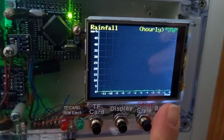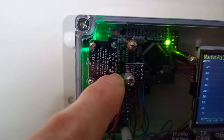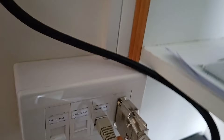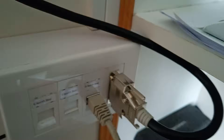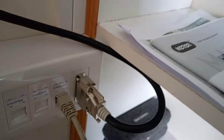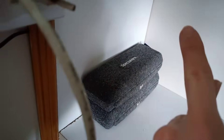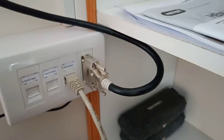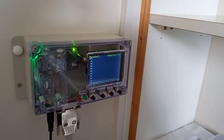Let's get the display on again. So the connectors — that's our internal temperature and humidity etc. Then our outside sensors go along this cable into this wall socket which I've added on my CAT6 panel. There's another BME280 just outside on this wall with the cable going straight through the wall to minimise the distance on the I2C. And there are two CAT6 cables going up to the ceiling across to the outside sensors, which I'll show you later.